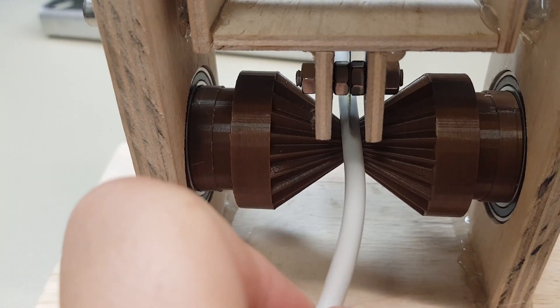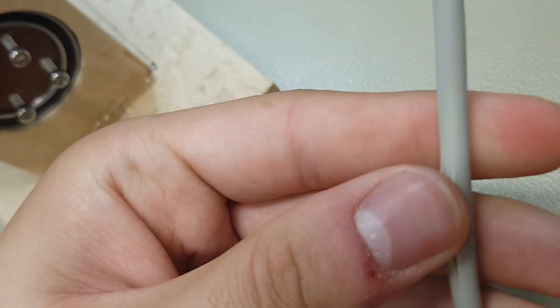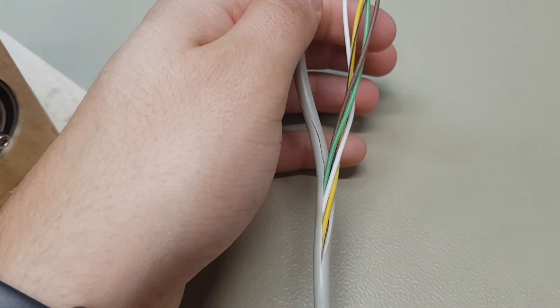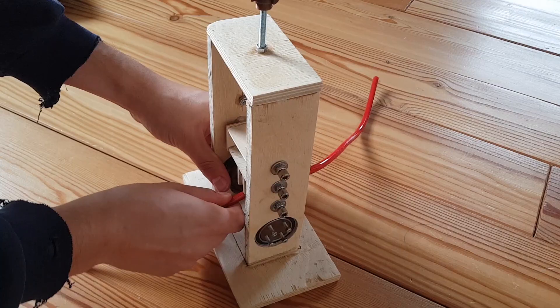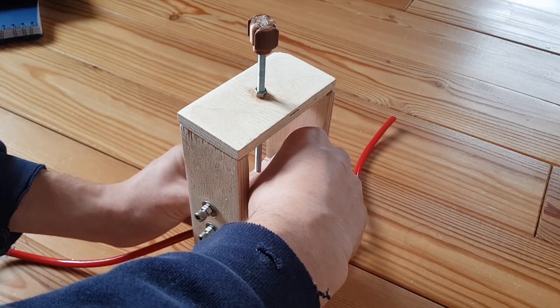Here is my first attempt at stripping cables with the cable stripper I made. Yes, this is an unpolished version because it doesn't even have a handle. But I'm actually pretty impressed at how well it works. And knowing that I made it and it works — well, that's just fantastic. At each side I added three bolts and nuts, so I could tighten the blade at the correct position and it wouldn't drift to one side while stripping the cable.